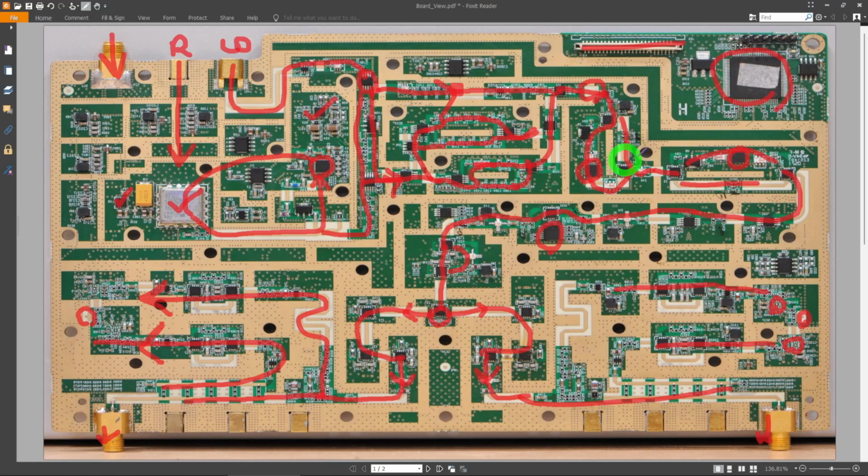And just to note why there are two doublers, I think there are two doublers because it needs to cover 8.5 gigahertz. And if you multiply this by 2, it only gets you to 8 gigahertz. So there's a half gigahertz missing. And I think this architecture probably can do more. So maybe there are other versions of this that they're thinking about, even to higher frequencies.